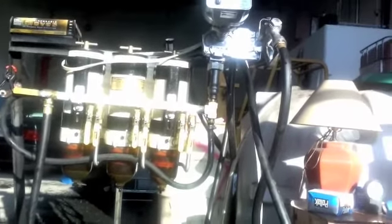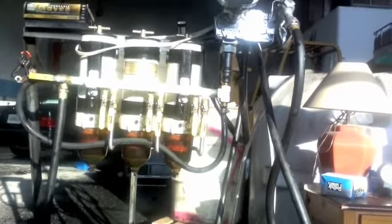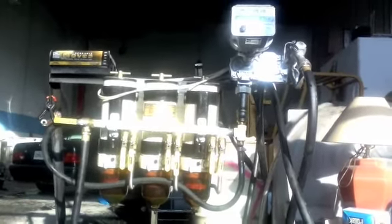It's three Raycor elements and they last between 500 and 1,000 gallons. But that's the oil right there that we've processed down to what's called stage 1 filtered, which has been dewatered and run through the filter set once. It'll go through three more times by the time it actually hits any customer's vehicles.